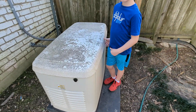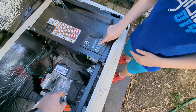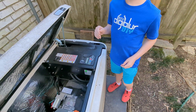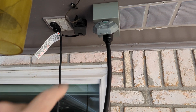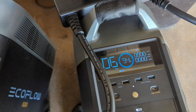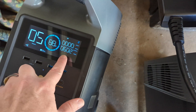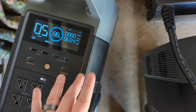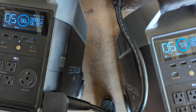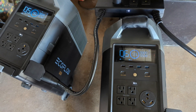We're going to lock out the generator just to make sure we don't need it firing up at the same time — we never know what might actually happen. Let's hit the red button — that turns off auto — and then let's pull the breaker down. That kicks it out and makes sure we're totally isolated. So it's plugged into the back feed up here. We'll fire up the dual voltage hub. We got juice. We got all the breakers kicked on. It looks like we're pulling around 600 watts off of this one and around 600 watts off of this one — a fairly balanced split phase. We're showing right at five hours out of both batteries.